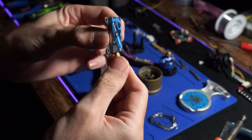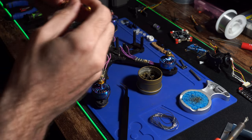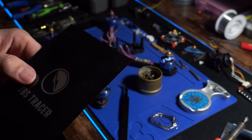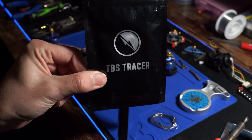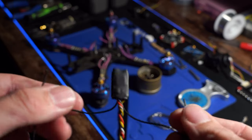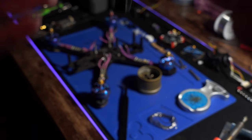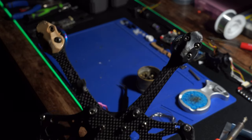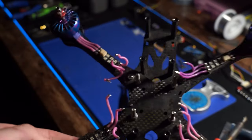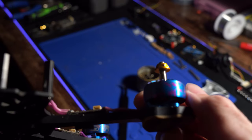This is all stuff I unpackaged before this and tested once off camera, so I'll be new to it on the first flight just like you would be. TBS Tracer is going in as the receiver — it's made by Team Black Sheep and is pretty much the successor to the Crossfire receiver. The main difference is it's made more for racers, with better latency — about three to six milliseconds reaction time. Express LRS also just came out as a competitor to Tracer.